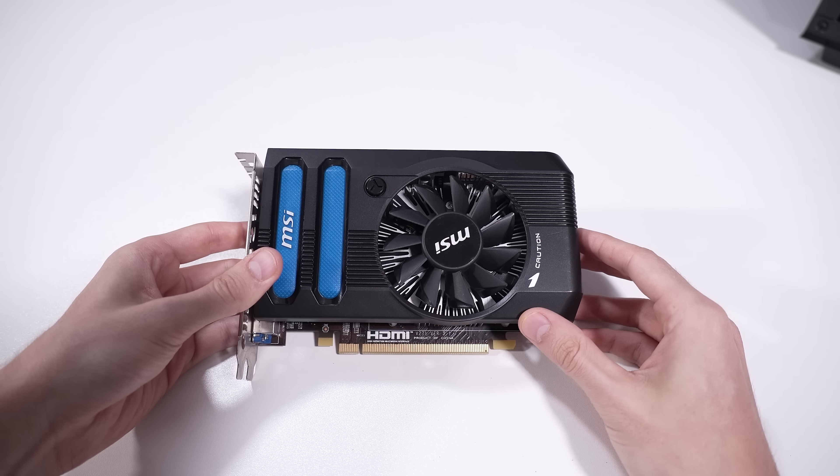We don't want to do this with thermal paste over the die. You can tell this is super fresh — I had just replaced it in that previous video. Getting this all cleaned up here. We'll make sure the area around the die is especially clean — that's where we're going to focus most of our heat. The remainder of this IPA should evaporate within a few seconds. There's nothing like seeing a bare, super clean GPU like this on a board. The card is propped up on this metal plate.